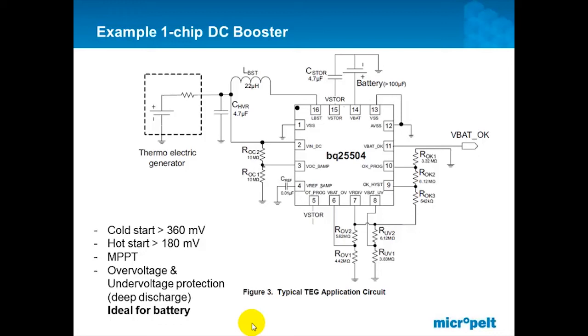So if the sensor is active, I use a buck converter, but a buck converter has a very high quiescent current. Damn it. The linear regulator might be some nanoamps, and the buck converter microamps or tens of microamps. So therefore you will have to open your suitcase of analog electronics and say, look, why not put those two in parallel or half in series, so that by microcontroller you simply say which regulator is working when.